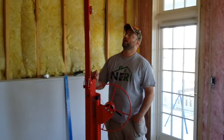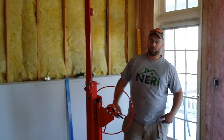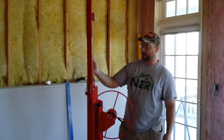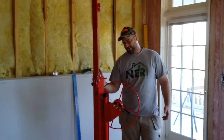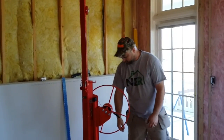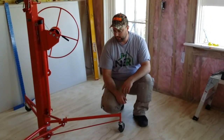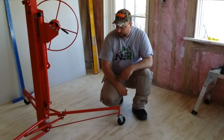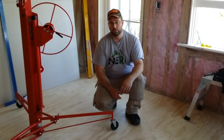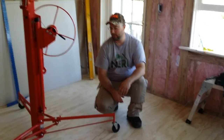I did notice this: when the unit is collapsed and broken down, the masts have a tendency to shoot right out the top. I think what you do is snap this up and into place — that locks everything so as you're carrying the upper unit, nothing goes flying out. Also, this thing's got gobs of grease all over the safety mechanism on the head unit — might want to wipe that down quick. The wheels are not bad, but they're a little hard — more hard plastic than rubber. They do all lock, which is good. If you're working on a finished floor, I'd recommend using a hardboard or ram board to protect the surface, since the wheels have a little ridge down the middle.